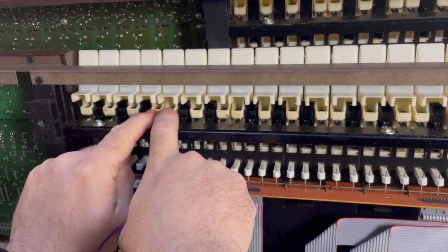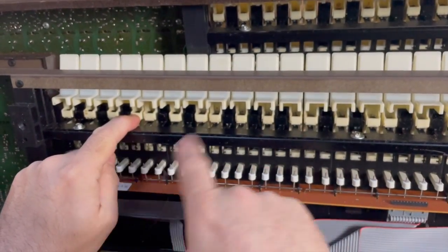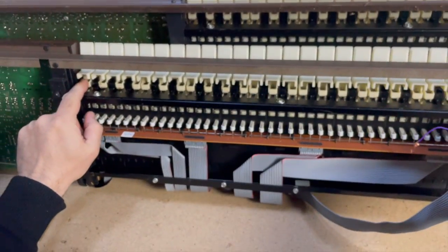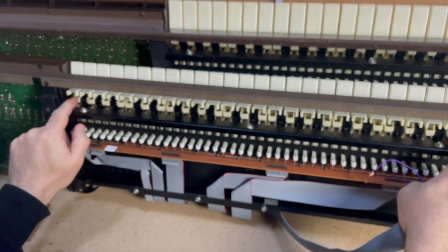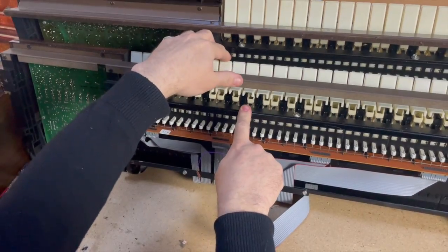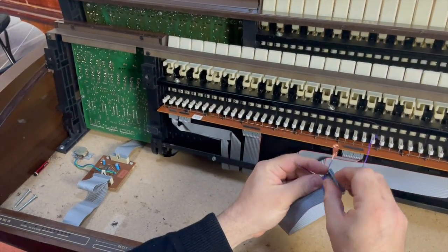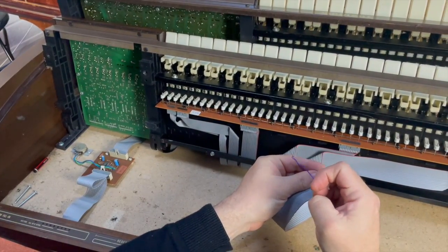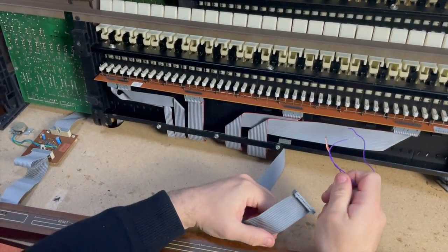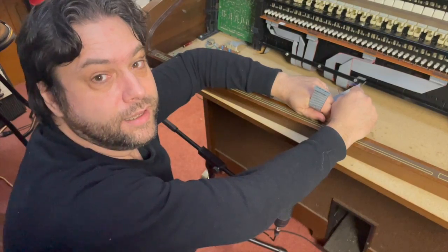I'm going to put pieces of copper tape on each of these bits of the underneath of the note, and then there's going to be the bus bar, which I'll probably just do with a piece of plastic or something like that underneath there, covered in tape. So then basically whenever you press down on a note, it'll be the same as doing this, just touching those things, or pressing down on an organ pedal note. And I'm not going to do this now while you're watching me do the video, but I'll do the modification in the next few days, and then there'll be an update.